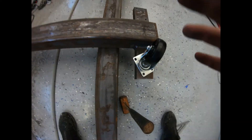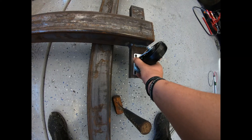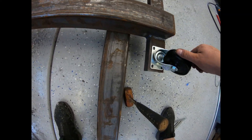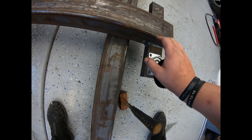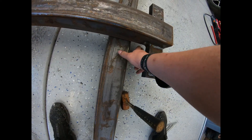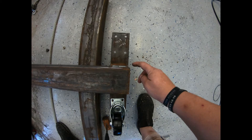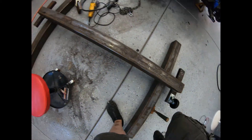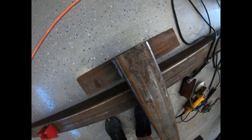So this is going to be — I was going to bolt them, but I decided to weld them instead. They're going to sit right there, and this gives enough room for it to swivel when it needs. Basically, this is going to be on the ground, and the pinch weld clamps are going to be on this side. Let's go ahead and get the wheels on — this is what I've done so far. I'm not using these bolt holes; I'm just going to weld over them. Did some welds, same thing goes for over here as well.